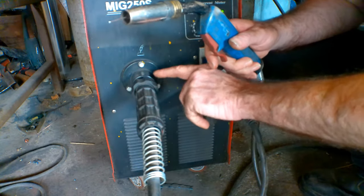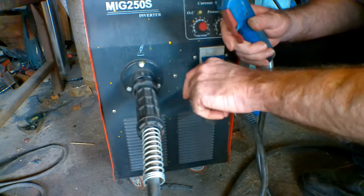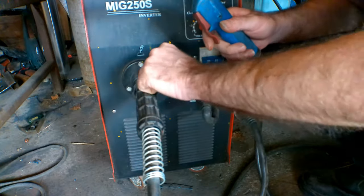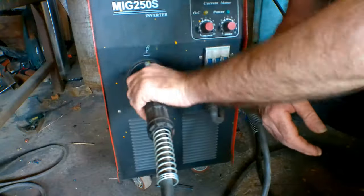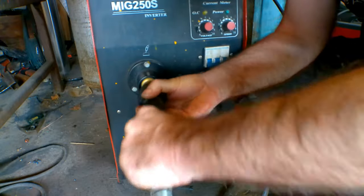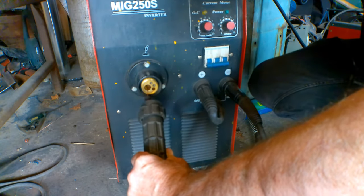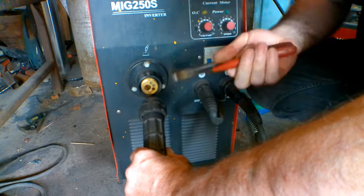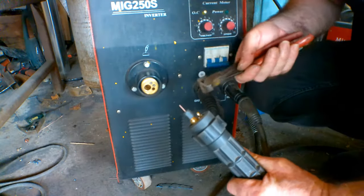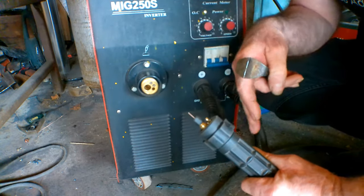The only way to do that is to pull something to bits. So because the wire is stuck in here and it won't come out when I push the trigger on the gun — can you hear that? It's just scraping. So what we're going to have to do is take this off. Sometimes when you get it really jammed in there like this, it's pretty hard to take off. So you undo it and give it a bit of a yank, and either a little bit of wire will come back from the torch or a little bit will come out of the machine. We managed to pull it out a little bit — can you see the wire in there guys? So what we need to do is just cut it off and we're free now. So we've got it disconnected from the machine.